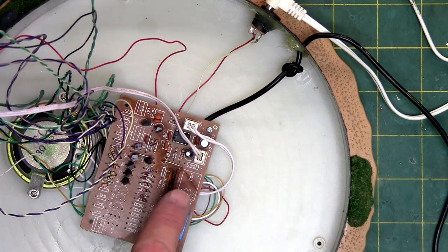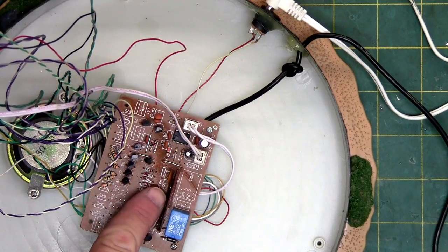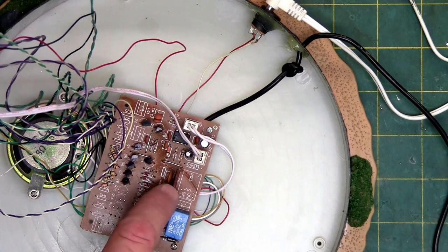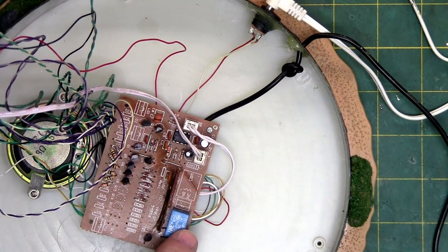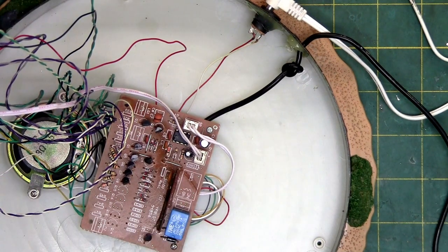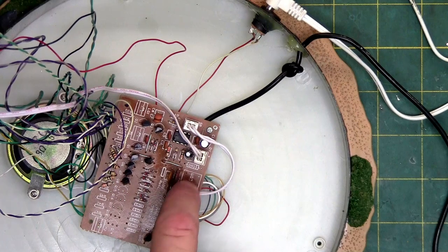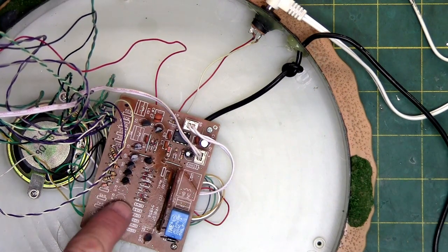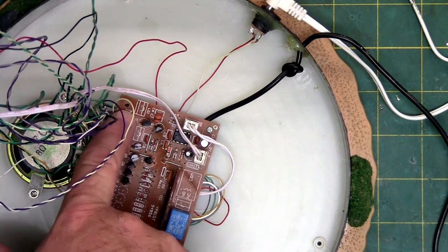This one is a smoothing capacitor for the blob chip, which is right there — that's why it says IC1, which means integrated circuit one. This is the relay that goes click, goes one direction, click, reverses it. This transistor with this diode work with it and help make the circuit complete. It does have an ability for a second relay, probably for another circuit branch or another board.